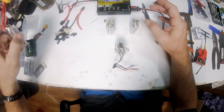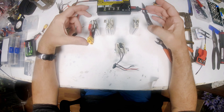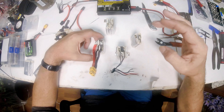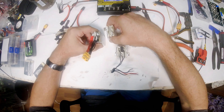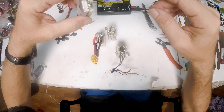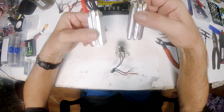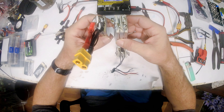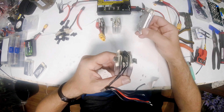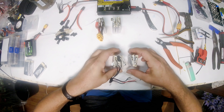How's the easiest way to do this going to be? We've got three cells here and three cells there. We've got one that's got four cells, one that's got three cells, another that's got three cells, and one with two cells. Instead of ripping all these batteries apart and trying to stick six cells together individually, wouldn't it be easier to take the two three-cell groups that are already together, put those together? And then the four-cell group with the two-cell group makes another six-cell battery. That's what we're going to do.